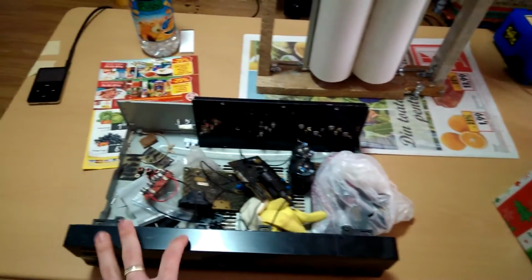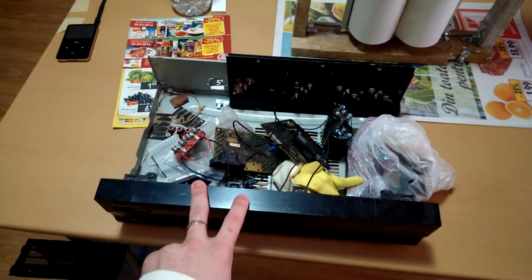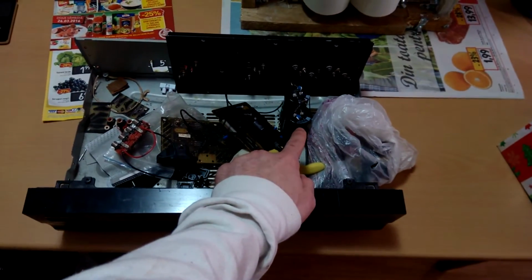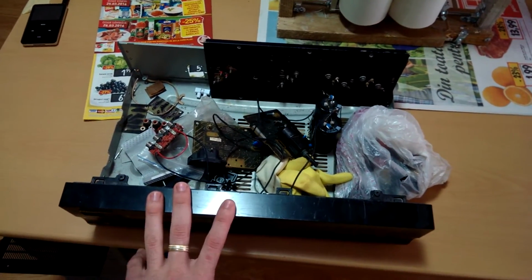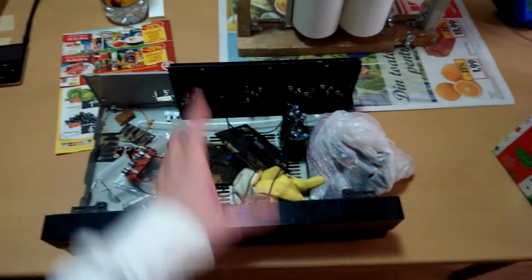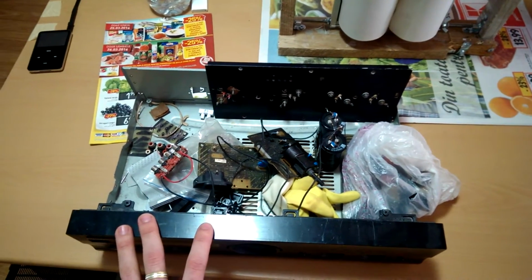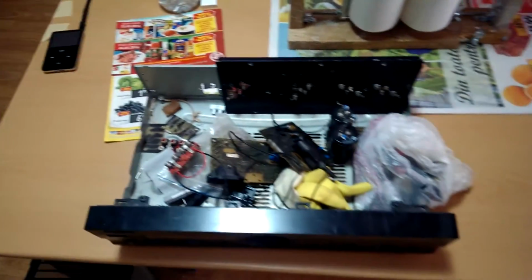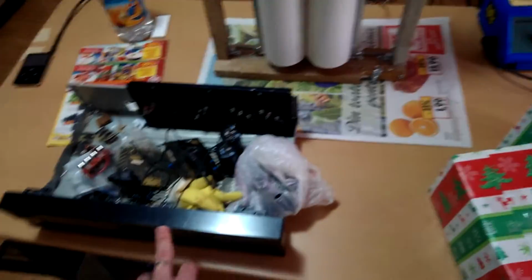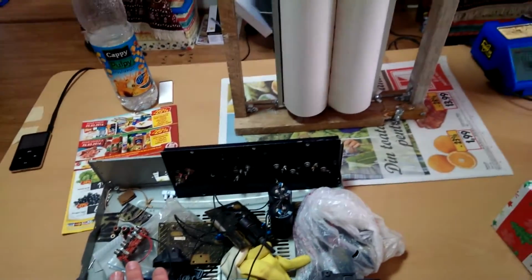On the front face, this would be the new amplifier that I want to use. It's a class AB amplifier with an output capacitor of 10,000 microfarads for the output, for the bass response, and for everything. If one output gets fried, it's no problem. They use the classic 2N3055 outputs, which are dirty cheap, and I have 40 to 50 of them stored, so it's no problem if they fry. That's why you see these outside, because I have to take this out.